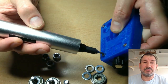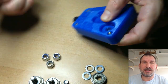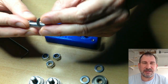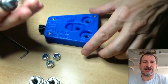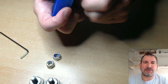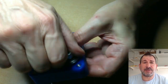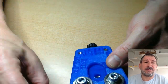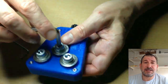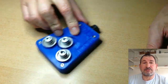The M3 nuts or screws hold the four corners together. Let the tool spin in your hand when it gets close to being tight — you don't want it too tight because you will break the plastic. It doesn't have to be very tight anyway, just slightly snugged up is fine. For the M8 bolts, two and a half centimeter bolts, I put two washers under the bearing because it holds the bearing up a little higher, and there are three of these — two are fixed and one is in the moving beam. Slide them in, tighten them up snugly with your M8, and just like that you've got yourself a working rail roller.